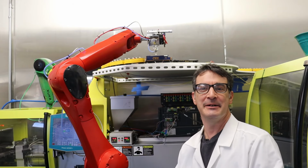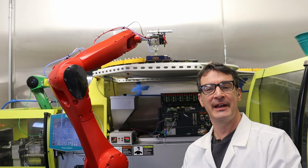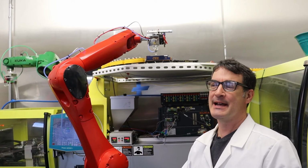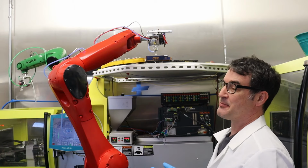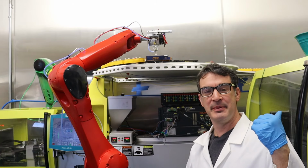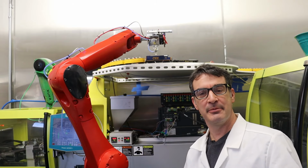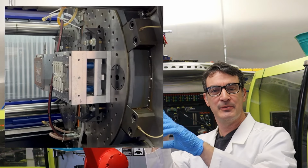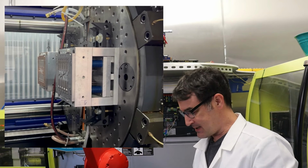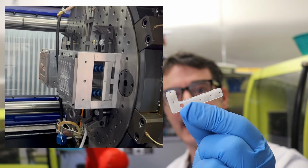So this week we've got a pretty interesting project. We've got a part conveying and collating system that I had to bring online to facilitate bringing molded parts from the large dual shot molding machine that the big yellow robot plucks out of the mold. In fact, this is a mold that we did in a previous episode. It's the dual mold where the platen spins and over molds rubber onto a polypropylene substrate. Actually, these parts right here, you can see that.